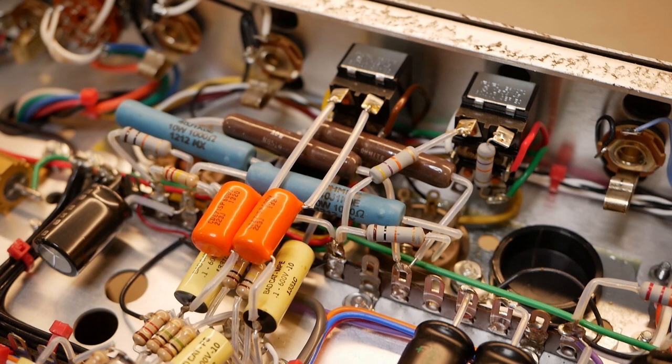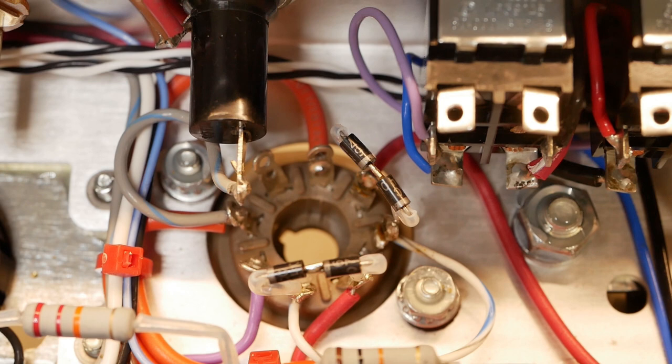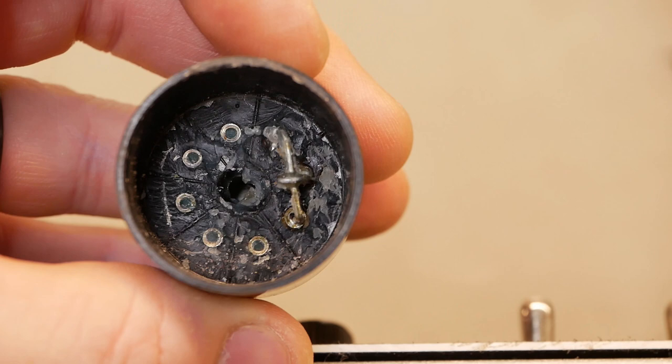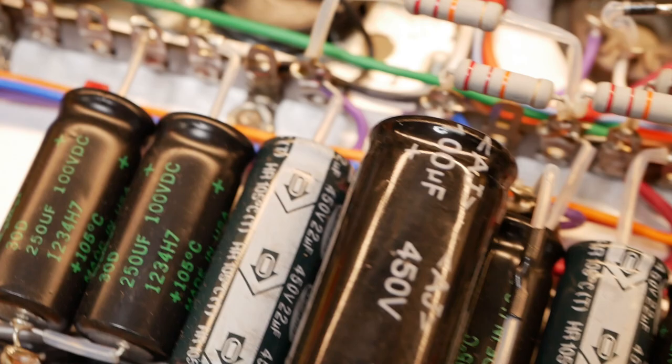Just a quick glance at the 1/2 switch — it's just changing between two values of phase inverter coupling caps. You've got the Bad Cat branded caps — that's how you know you've made it — 0.1 microfarad and 22 nanofarad. So you've got fart city or flavor country. Here's the weird arrangement around the rectifier socket: voltage coming in on pin 3 and pin 5, which normally wouldn't be used, then it goes through the series diodes on pins 4 and 6, linked up by that blue and white wire, and then via the valve base with pins 6, 7 and 8 linked together — going to that purple wire and that red wire.